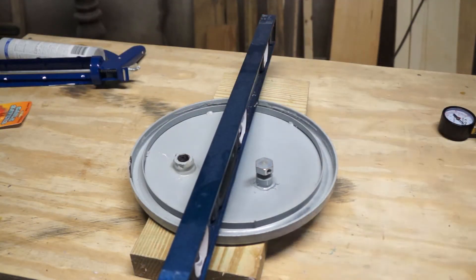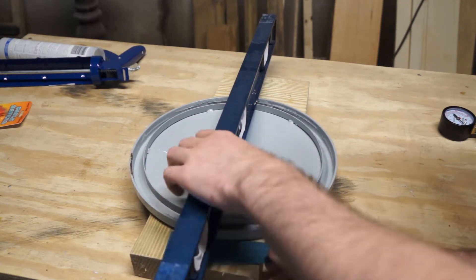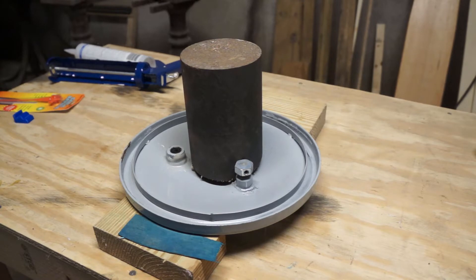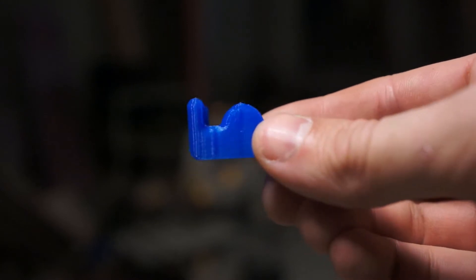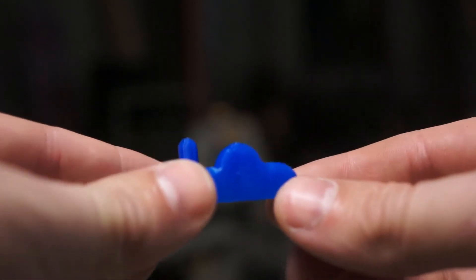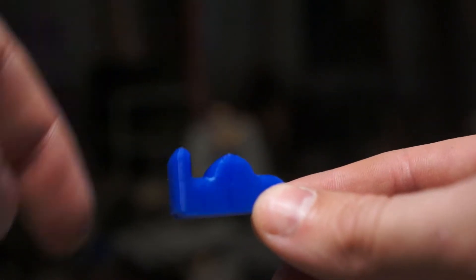I pulled the stock gasket out of the lid of the pot and flipped it over — we're going to be making our own gasket that actually works. To do this I braced and shimmed the pot lid so it was level, then put a big chunk of tool steel on it to weigh it down. Next I grabbed this — a 3D printed part I designed that rides along the outer rim of the gasket cavity and will impress the shape of the rim of the pot into the gasket material. The gasket we're replacing was flat — a flat surface to seal a curved one. Our surfaces are going to be curve to curve.